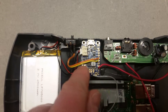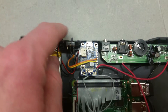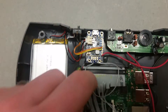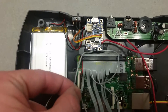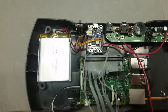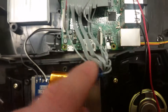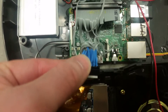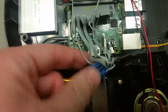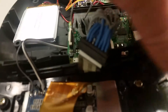You've got the Adafruit 500C Power Boost, and the enable and ground pins are wired up to this power switch — when you turn it this way it breaks the connection and turns the unit on. You've got 5 volts out here, and this 5-volt ties right into the Raspberry Pi's pin 2. For ground I used pin 9 — a lot of people go with pin 6. All these GPIO pins are wired up to the original flat panel connector that connects to the Lynx's body.